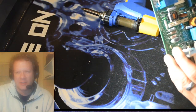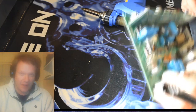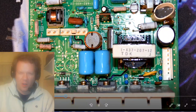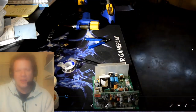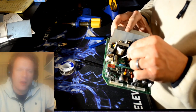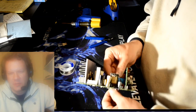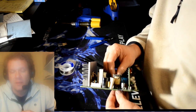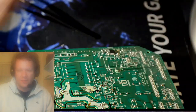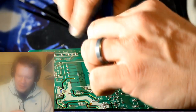What Sony did was use extremely high quality capacitors, especially on these 20L5s. If you look at the capacitors you'll notice a lot of them are metal-topped — really high-end versions. So even nowadays, if the monitor doesn't have a lot of use, a lot of these capacitors will still be good. Now if you're really serious about replacing every capacitor in your PVM, just note that on this one it will be a colossal task, and it's definitely something I would not recommend for anybody on a novice level.